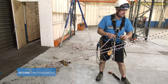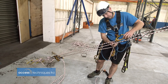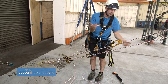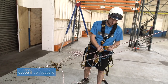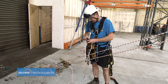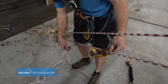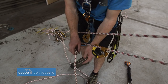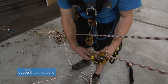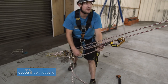All I'm going to do is just put a jammer on, pulley on the out one, clip it in and then just pull it hand tight — that's all it needs to be. I'll do exactly the same with the other one: put the jammer on, pull the tail of your ID rope, clip the pulley on, slide it up, and then just hand tight. That's all it needs to be. You don't need to go crazy.